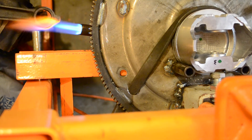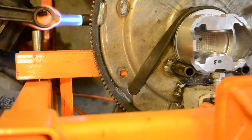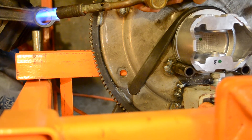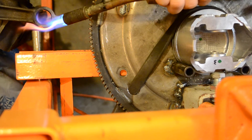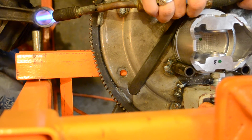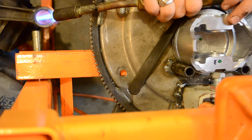I'm just heating up the end of the rod here. I heat this end up first until it gets really hot — maybe even a little bit red. I don't know if that does anything to the metal, probably not — I think it's cast iron. After I get this end hot, we'll move to the inside and get that hot too, so it kind of heats up the shaft there. Then I'll flip it over just to make sure we got all our bases covered with good even heating. I got the pin over in a bag of ice, inside its own plastic bag so it doesn't get wet with condensation.